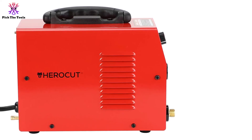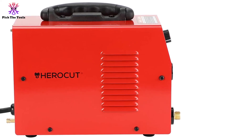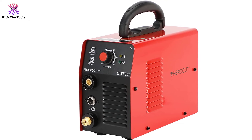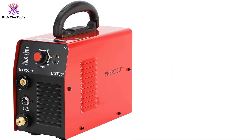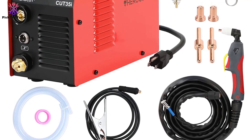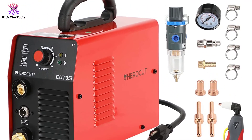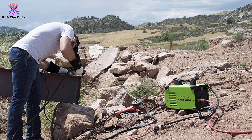The advantage to the thin cutting ability is that the cutter only needs to be wired to a standard 110-volt outlet to achieve a 0.3-inch depth. Even then, it's able to pull up to 30 amps of current and sustain a 60% duty cycle, which is on par with much larger plasma cutters. The HeroCut comes with everything you need for assembly, though users recommended adding a quick-disconnect fitting to make connecting to the air compressor easier. Unlike many competing cutters, it doesn't include an LCD screen, but this is mostly unnecessary given that the only control is a current dial.